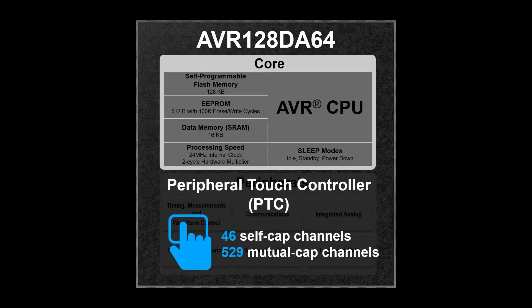The AVR-DA includes a state-of-the-art capacitive touch interface that can be used for buttons, sliders, wheels, and 2D surfaces. They include technology that provides better noise immunity, moisture tolerance, and enhanced sensitivity for more responsive and problem-free designs. The included auto calibration ensures your design works well in all environments and for line or battery-powered applications.